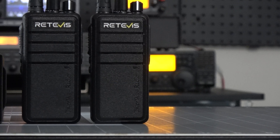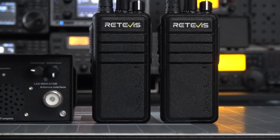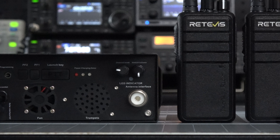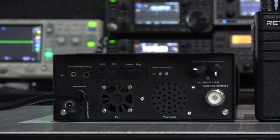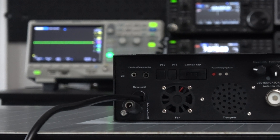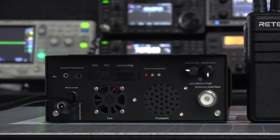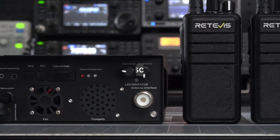Overall I think it's a pretty cool system, especially with it being a real-time simplex repeater — something I don't believe currently exists on the market. In addition, if you're looking for privacy while staying within FCC regulations, this is the only LoRa radio system I'm aware of, and someone would need another one of these to listen into your communications. With it being channel-based you could program a different frequency instead of the default 16 to make it even more difficult to intercept. If you're interested, I'll leave an affiliate link in the description below. That'll do it for this video — if you found it useful please give it a thumbs up and subscribe so you won't miss upcoming videos. Thank you all and have a good one.